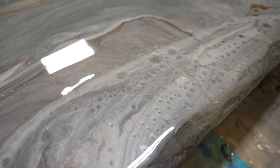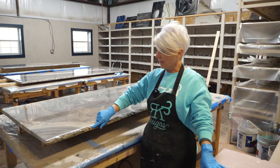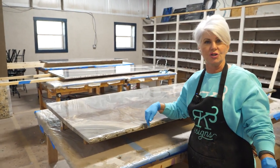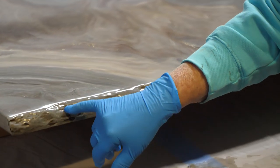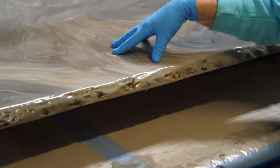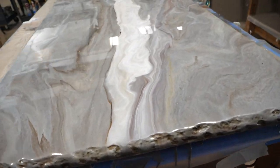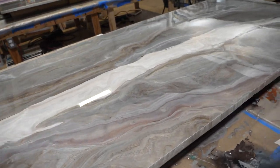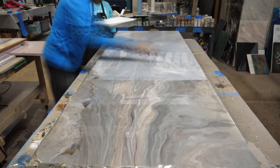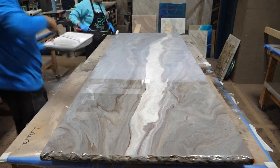It's been 24 hours. Our tops are dry. We pulled the tape and I went in and put a glaze medium on our rock edge, which looks really cool. I'll link a video in the description below showing how we did the glaze and how we made that rock edge look really natural. We're going to be doing the matte UTC on these foam boards. I'm not going to do a flood coat because our finish laid out so well — I don't have any imperfections. These are not high traffic areas like a countertop, so going straight with the UTC is perfectly fine.